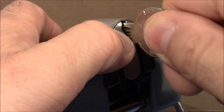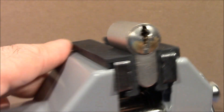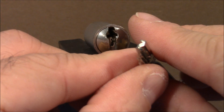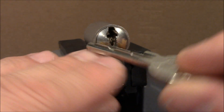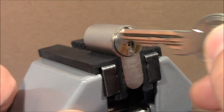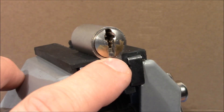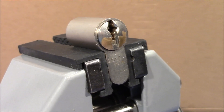Just need to make sure that I don't pull out the plug because there is no back clip. What is special on this lock is a built-in security feature. We can see two grooves left and right here that match the key, matching to this little bar here on the left and on the right. When we use the key it works perfectly, but when we pick we have to do something in order to get a full rotation. So let's give it a try and pick this lock.